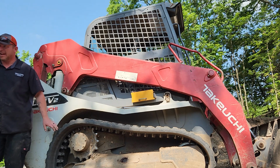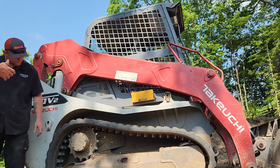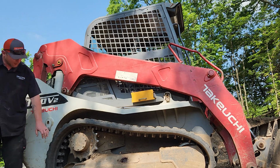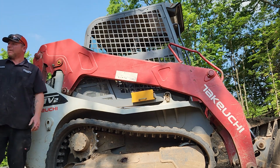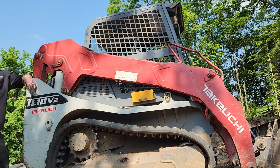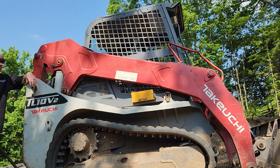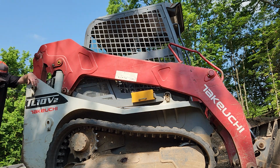Okay, that's moving one set of teeth off a roller. Jump track is when it comes completely off. I was on a service truck for 15 years, and I've had them to where it was just me. I've had to take come-alongs and hook it on this side of the track to the other side of the track, put tension on it, and then roll it.